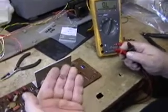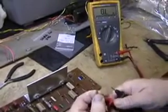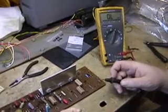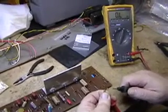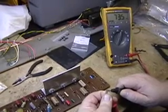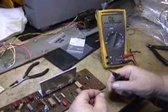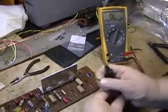Here's another example: this one is 56k ohms. When measuring, keep in mind that if you have something else across the resistor — like a transistor or a diode — it's possible to affect the reading slightly. But this one reads 73.5k ohms when it's supposed to be 56k. Its maximum tolerance would be another 5.6k on top of the 56, but 73 is way out of the ballpark.